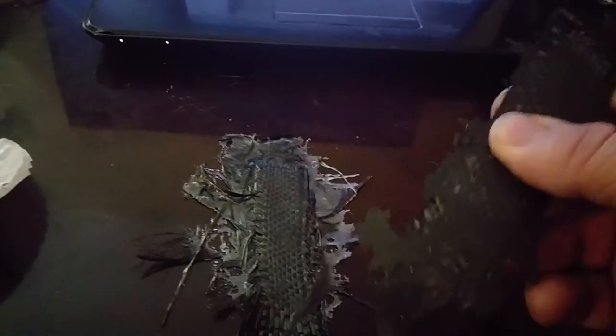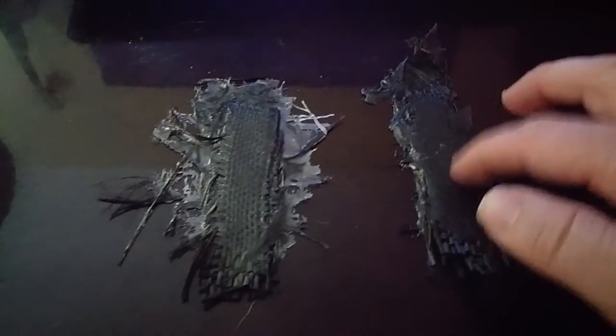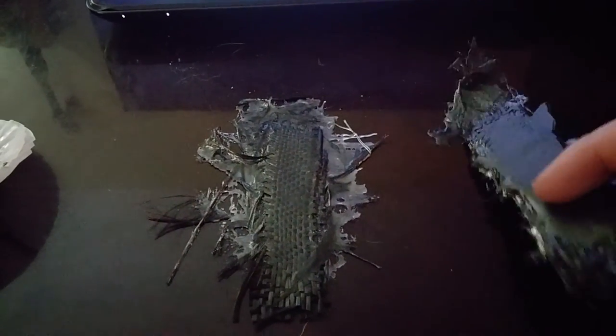It's not very thick, but the graphene with the carbon fiber is noticeably stiffer. You can actually feel it — you can put it in your hand and push in the middle and it's tough, like what you would expect a car hood or something like that. While the regular resin has a little bit of give — a lot more give actually than I expected. I didn't expect it to be as flexible, but it's only six layers of laminate. This graphene version is very, very strong — feels stronger than ABS plastic. I don't think it's quite as strong as the ABS I made with the graphene where I used a wrench to snap it, but it's still very, very tough.